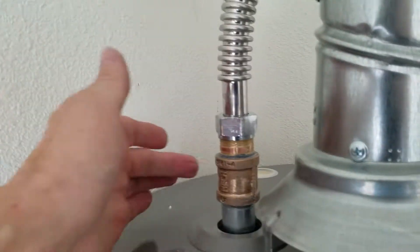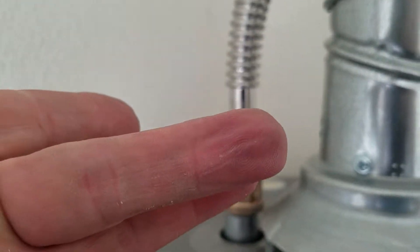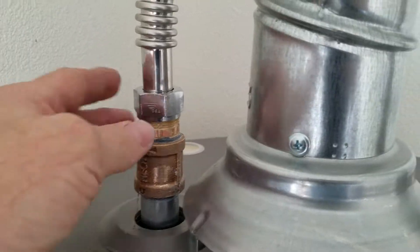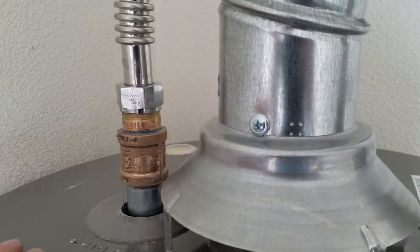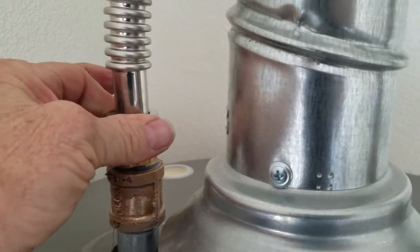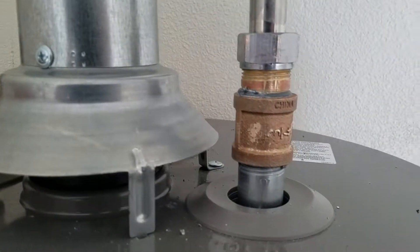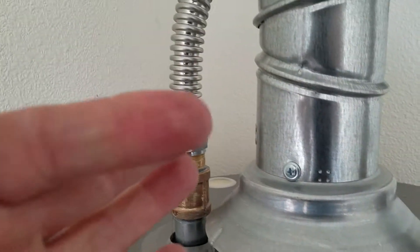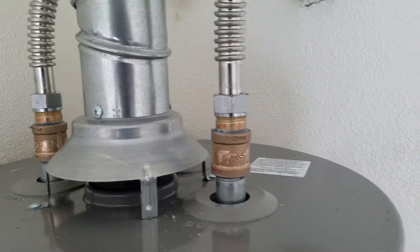Right now I can see — I don't know if you can see on the video — but there's no weeping, no dripping, no spraying, and that's good. You do want to monitor this though; come out occasionally and look at the tank. Make sure you're not developing any water. As the water heats in the tank and starts going through the hot side, everything kind of softens up — the gasket in here and whatnot — so just keep an eye on this for water. Any signs of even just a hint of moisture, a little dripping, whatever — give us a holler and we'll come out and get that tightened up for you.